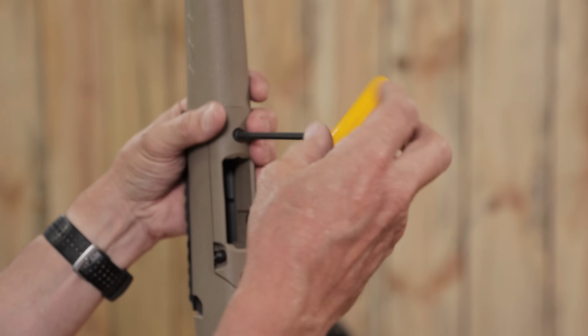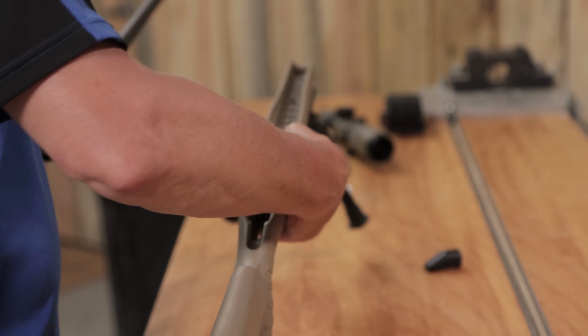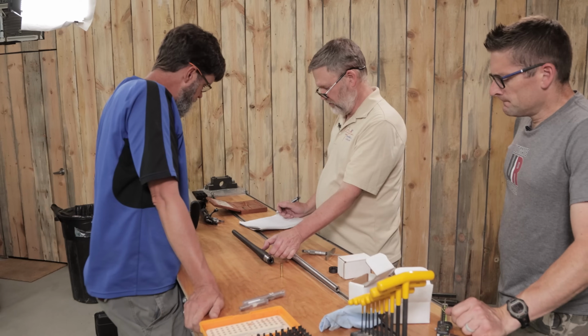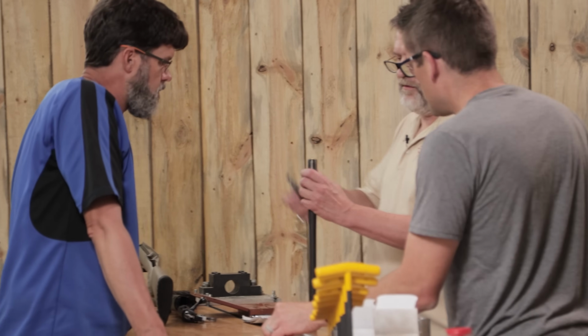And so before we even went to the lathe, we took the takeoff barrel. We loosened the nut, took the barrel off, and made kind of the typical cheat sheet, the tenon print, if you want to think of it that way, for reference dimensions, and the go gauge to get our protrusion.